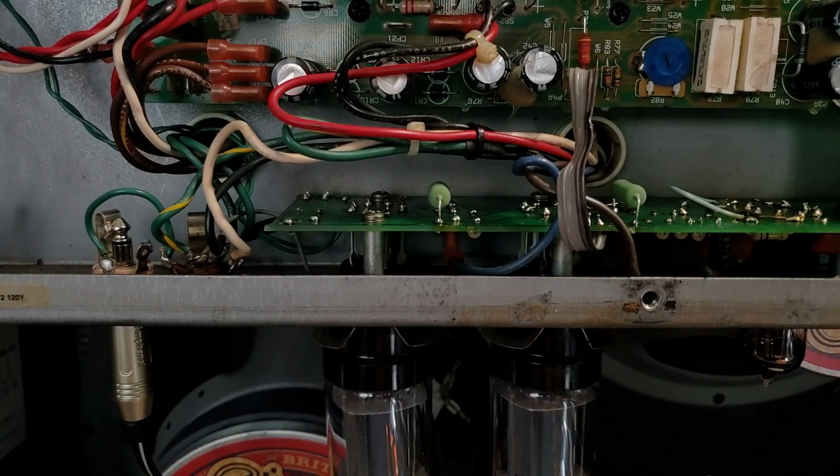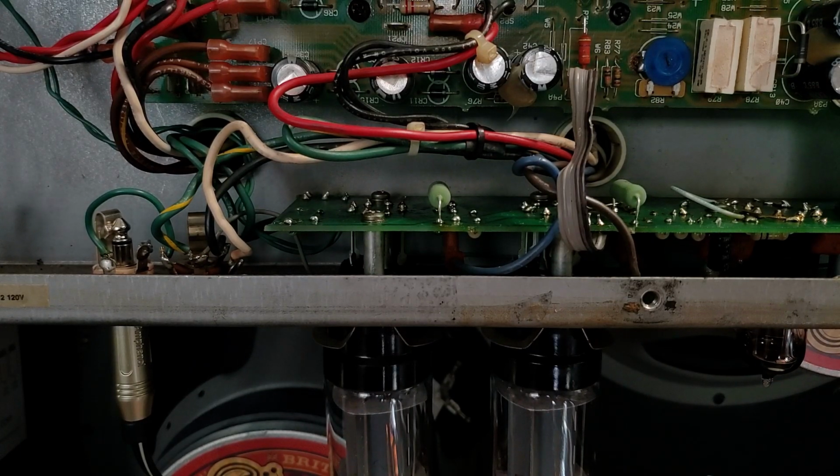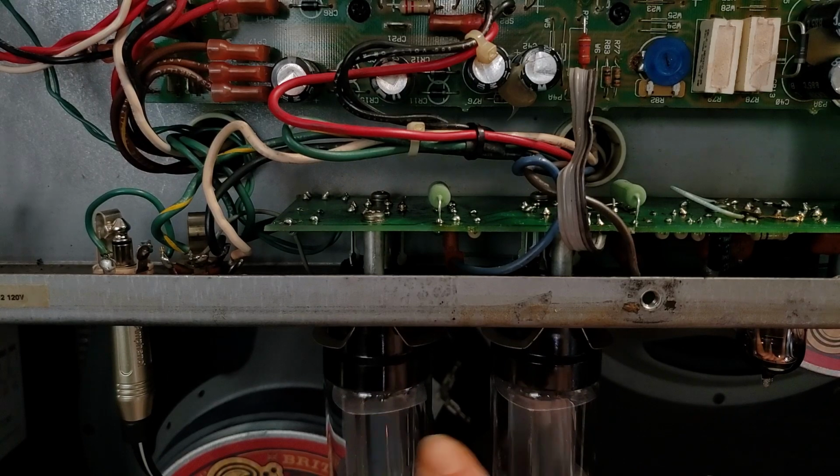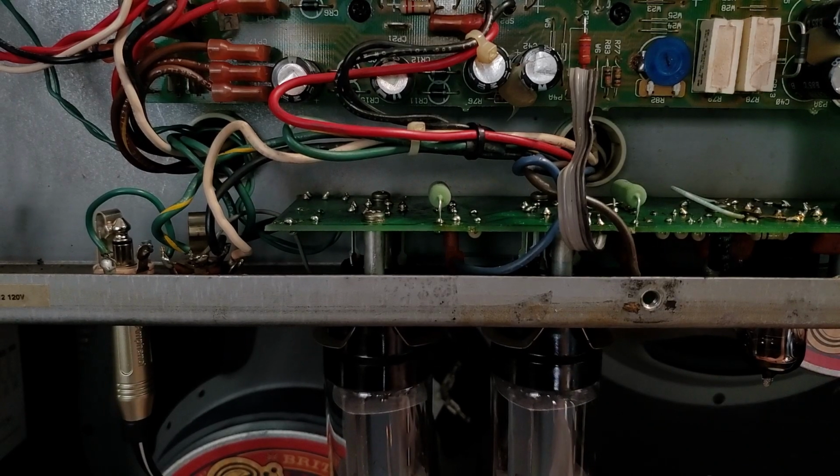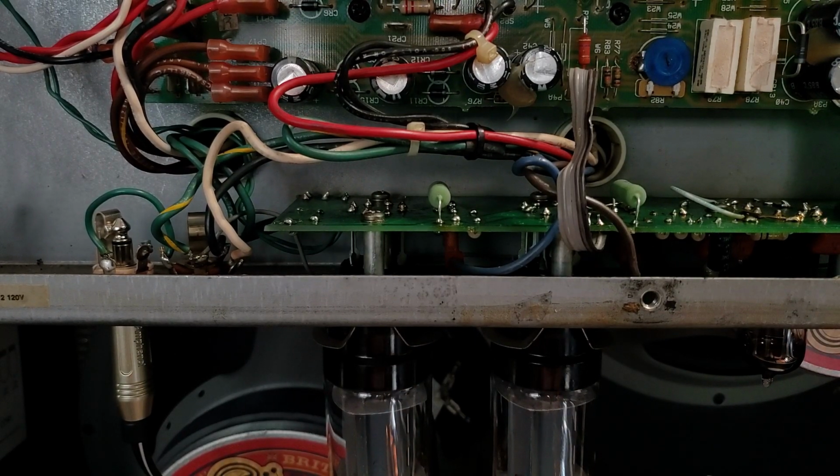There was still a ringing sound on certain notes. And at some points, the amp would begin to motorboat unless I touched one of the 2 output tubes. I didn't touch them here where the plate is. I would have burned the hell out of myself. I touched the bottoms, which you can't see here, and only briefly.